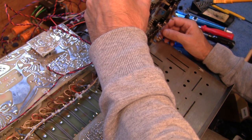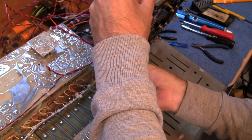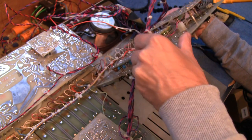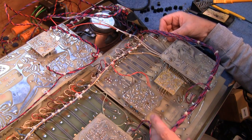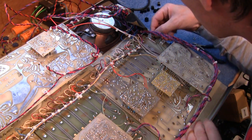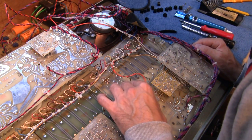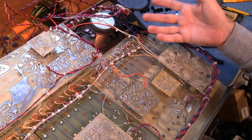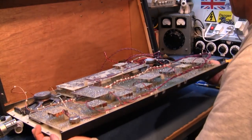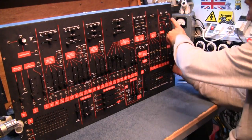Right. Yep. Everything looks good there. Line that switch up, and now you've got to get all these sliders to just line up so everything drops into place just nicely, and it sounds easier than it is. That little jack plug needs to go through there, and I'll just check that that push button is lined up correctly there. And with any luck, that's fixed. Put a couple of screws in and flip it over. Well, everything's through the holes where they should be.